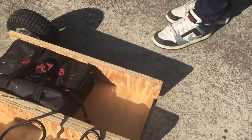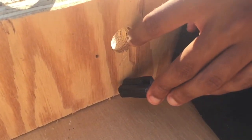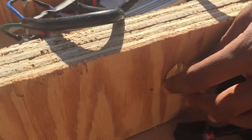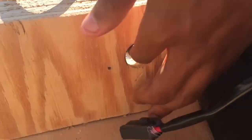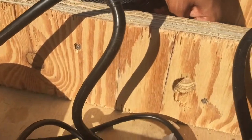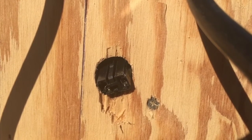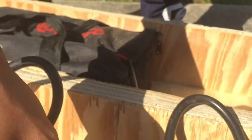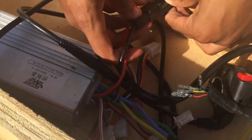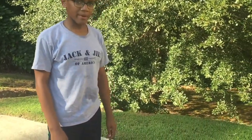You're just going to put the battery on the left side, and like the hole I was talking about in part one — this is drilled with a one and one half inch wide hole using a spade bit — drill it in the middle part. You can put the battery cable in there, and right here the battery cable of the controller you can plug it together.